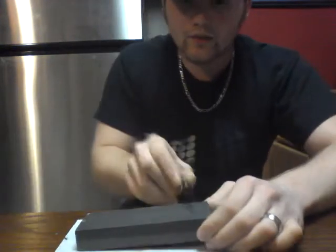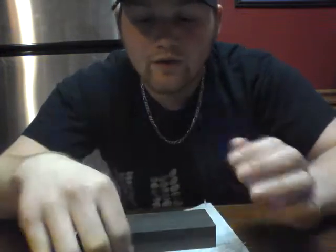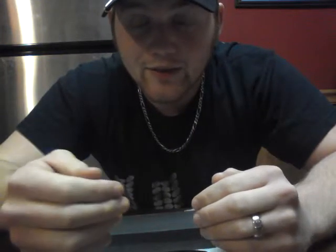As far as the angle, whether you're flatter or more up here scraping across, the skinnier you are, the flatter it is, that'll be more razor-like, and you could slice things easier with that. If you have it more up in the air like this, at a more blunt edge, as it were, that's for things like axes, for example, where you're hitting stuff and you don't want the blade to chip out. So you want it at a blunter edge for that sort of thing.